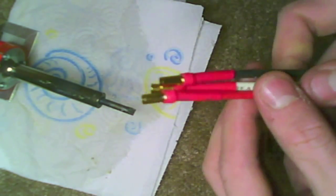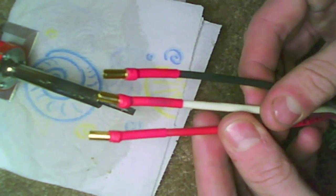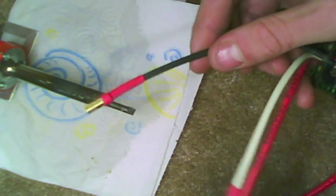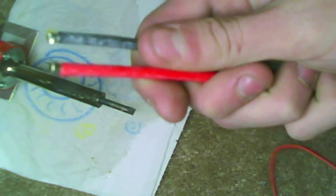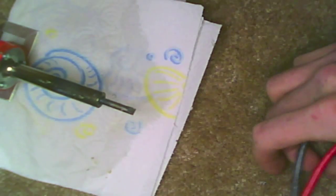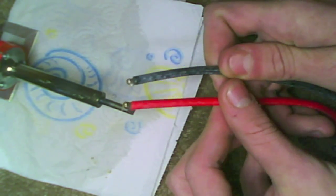Just a quick recap — here are my three motor wires with my bullet connectors and heat shrink finished up. I was going to do a segment on heat shrinking but I think that is kind of self-explanatory. All of them look good — it doesn't matter what color heat shrink you use because my motor wires themselves are colored. As long as all of them feel good and sturdy, we are going to move on to the business end and slap our Deans on. We are going to repeat the same process. Go ahead and pre-tin your wires — they are already pre-tinned but I add a little more just to freshen it up.